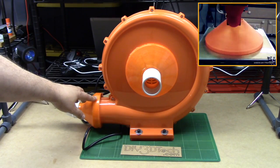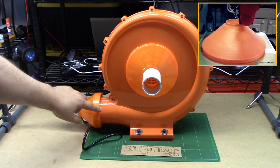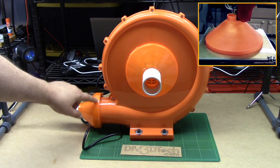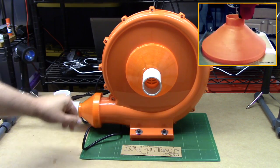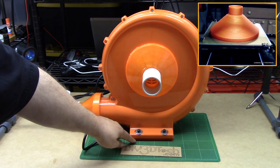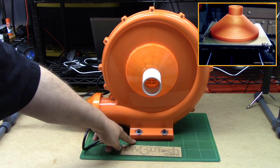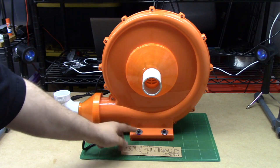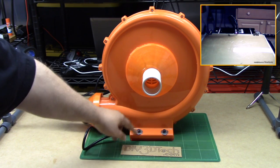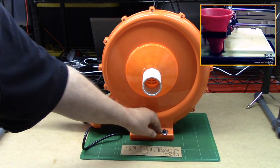I did nick it — I had a little bit of lifting on this and I got smart and put it on the lathe to turn it, which did not work well. So I have a little nick here, but that's fine. The other thing I did is I printed TPU vibration pads for this to sit on, and then used quarter-20 bolts with fender washers to come up and hold this in place.